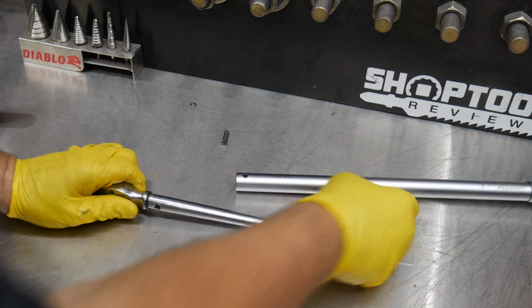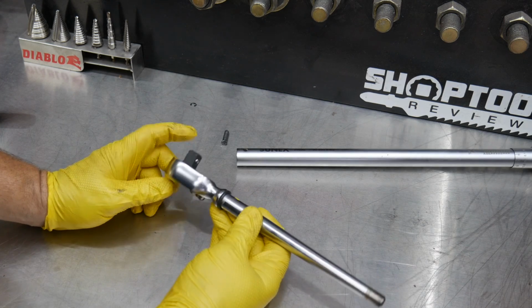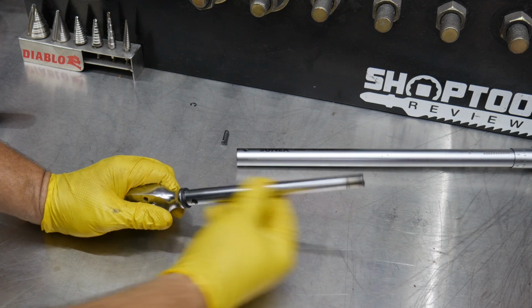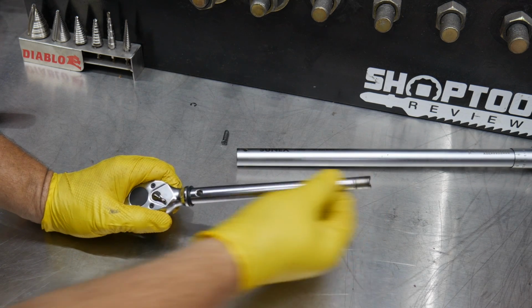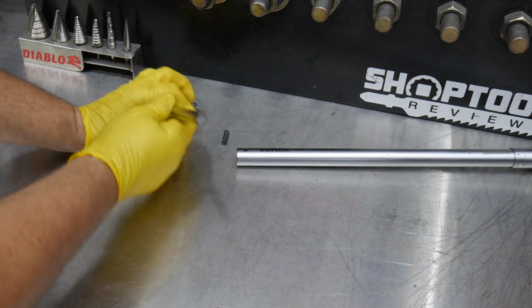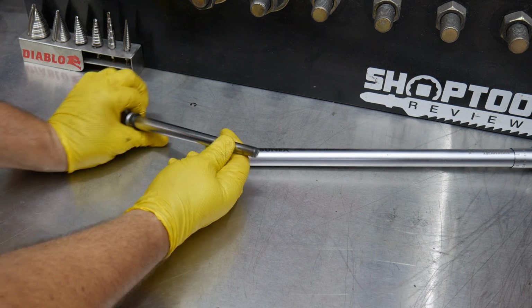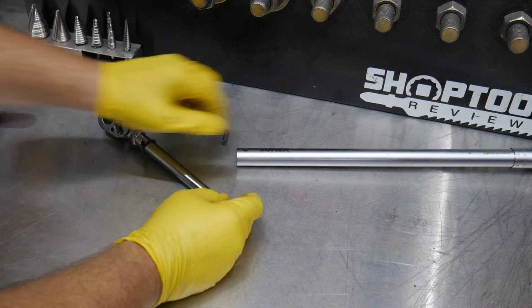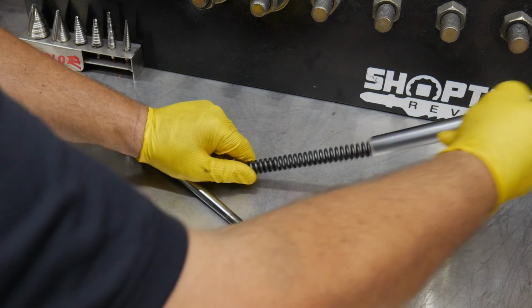So pull this out, and you see that this is kind of the business end here. So this is on your anvil side that's applying the force. And you see a conical shape, or a cone shape, if you will, where you've basically got a tapered shaft. You also see kind of a keyed shape here on the end. So basically there's a groove there where something rides, and we'll see here in just a second as we dump the contents out of here.